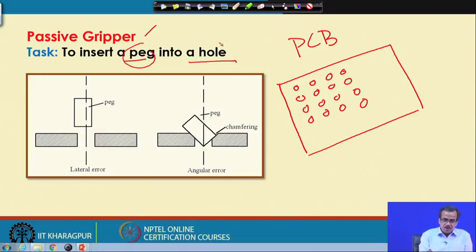How to insert a particular peg into a hole? This particular schematic view shows that I have a steel plate and on the steel plate we have one circular hole. On this circular hole we will have to insert this particular peg. Supposing that this is the center line for this hole, and I have this particular peg which I will have to insert. This peg is gripped with the help of the gripper and the robot is going to put this particular peg into the hole. There is a possibility that this part of the peg is going to collide here, and due to this it will not be able to insert. This is known as the lateral error — the robot will not be able to insert this peg into the hole.